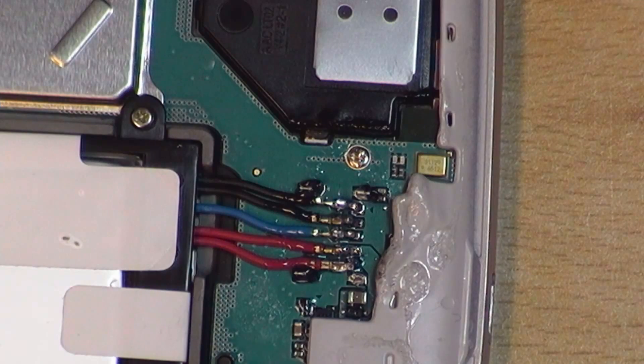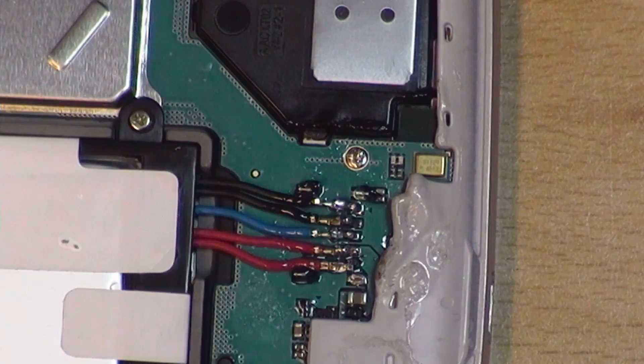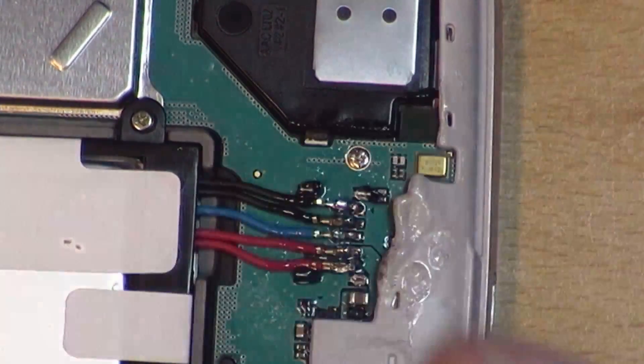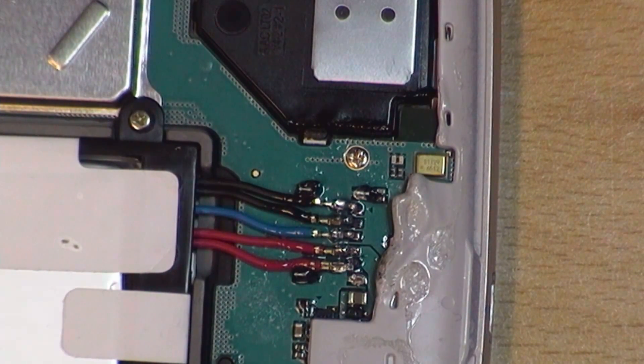And that is basically the conformal coating on. I think this takes about roughly two hours to cure. It's quite hot here in the UK at the minute — we're up to about 20 to 30 degrees, so it might dry a bit faster. It does smell, though. I might go back and put some more on. This conformal coating is just to stop any electrical interference and make sure we're not going to have a problem where the positive and negative wires are touching. If it gets dropped and the wires come loose, they're all going to be coated in conformal coating, and that's going to save us any future jobs, hopefully. I might put another layer on, but I won't bore you with that.